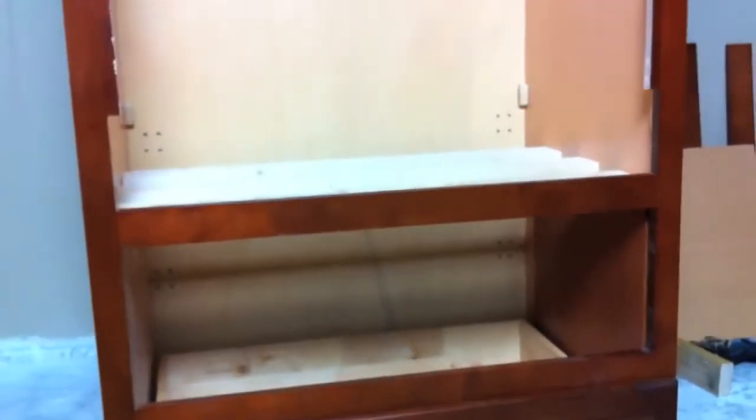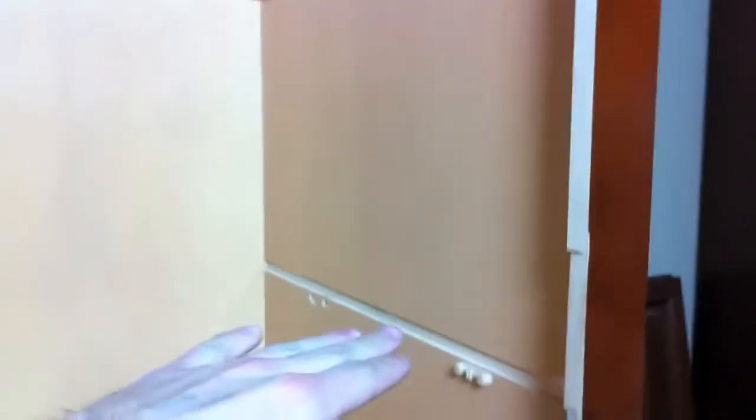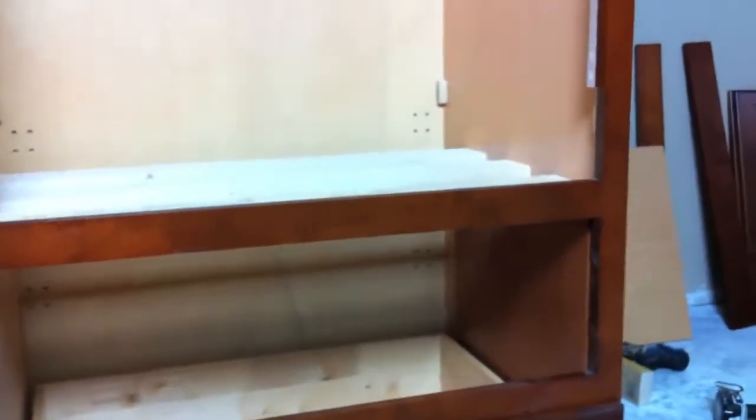Alright, so the next step in our single oven to double oven conversion — we got the cabinet put together and did a few things I wanted to point out. There's a lot of weight that sits here. This used to be where a shelf was, and your single oven would sit on that shelf normally. Because we're doing a double oven we had to open up the opening bigger, so what we did is build a frame for it since the double oven is pretty heavy. There's our double oven right there — we wanted to reinforce it a little bit.